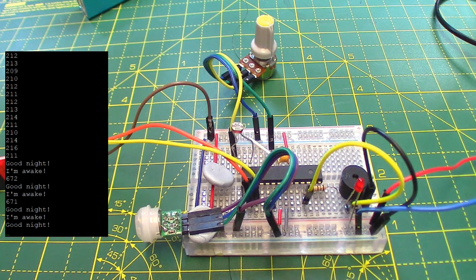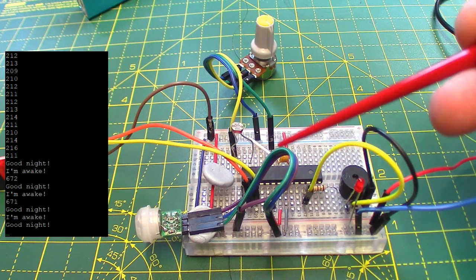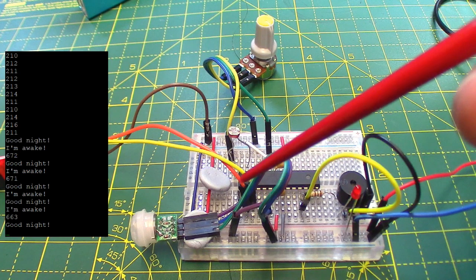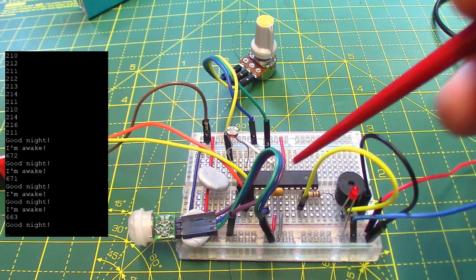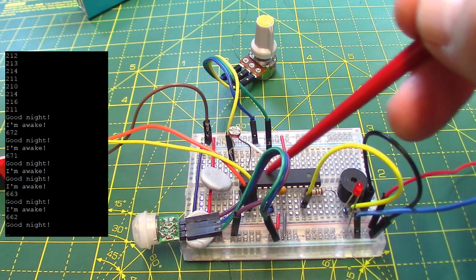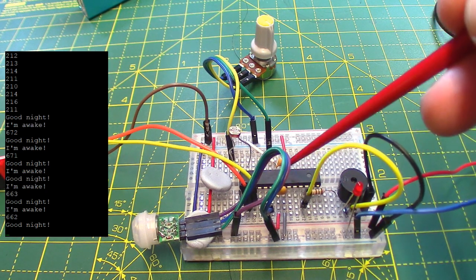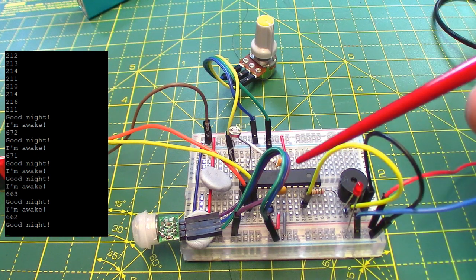So the Arduino, well, I say Arduino, the ATMega328P simply has a couple of decoupling capacitors, one of which you can see through that wire, and there's one, there we are, look, the other side, basically across both power pins. This side over here is the analog side, and this over here is the digital side. The designers have kept those bits of the chip separate, so you don't want digital noise ending up on the analog side, because that'll obviously corrupt the signal.